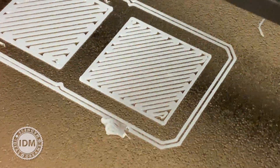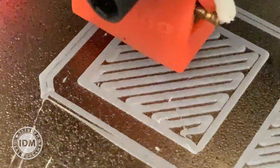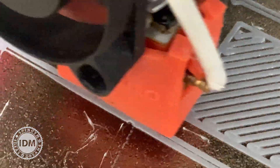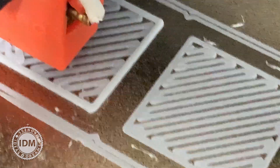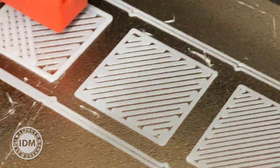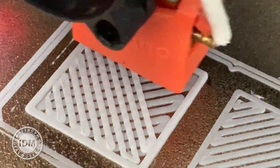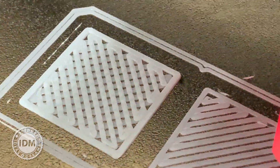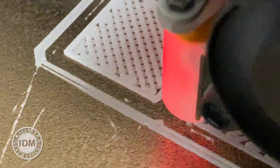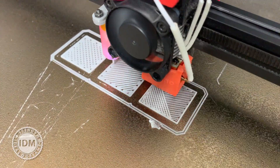It does look like there is some kind of overall percentage at work here — maybe my lines need to be 30% closer together. I'll try that next, but you can see the problem. I'm going to let it run anyway and try to measure these distances to get a percentage and relate that to the extrusion line width.